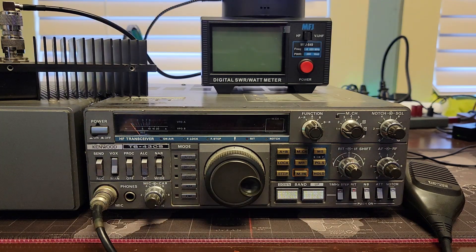Turn her off. So maybe this wasn't done when the radio was brand new, but after it had been sitting for a while — unloved, unused, or just not used on those particular bands — or if people smoked a lot around it. This radio doesn't have any evidence of being heavily smoked around, but this resistor, on the other hand, was getting smoked pretty hard. It got very, very hot — so hot that if I touched it, it would have burnt me. I did touch it. It did burn me. I'm that kind of experimenter.